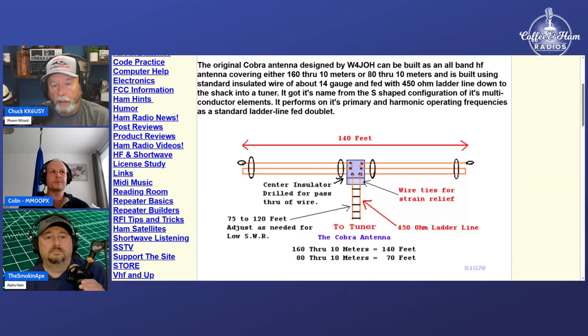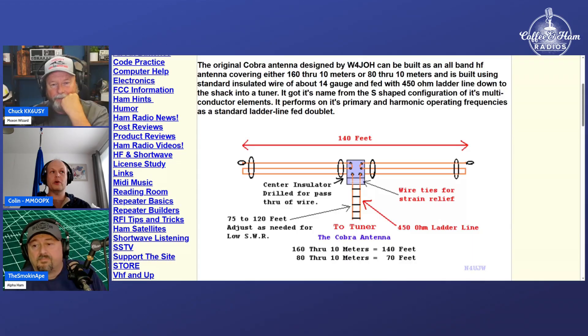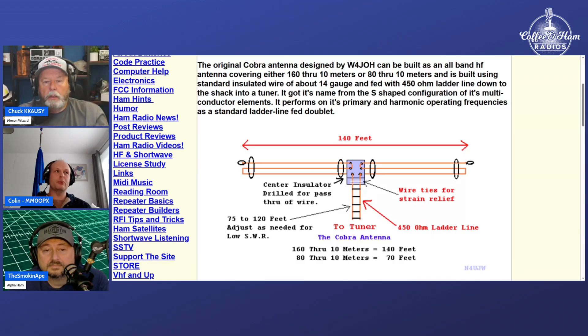That's what I've found. The one I ended up building was a 40-meter commercial version, but every time it says 40, it'll do 80 — though 80 probably isn't great. I was actually able to tune 160 to about 2:1 SWR. I wouldn't use it there — it'll probably kill something. The reason I did this was because on a 12-meter spider beam, using 11 meters of it, I was able to get 80 meters on a 40-foot mast. It's reasonably efficient with that big spacing, and the big bonus was you weren't limited with power — you could put as much power as you want through it. You wouldn't fry a trap.